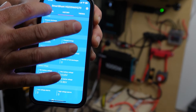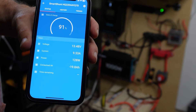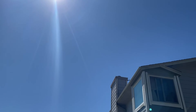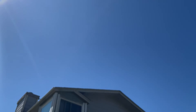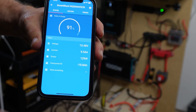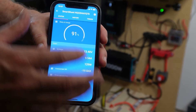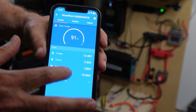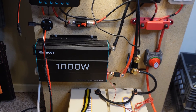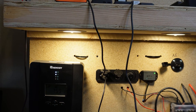In the future I'll be adding to this and seeing what I can do. Running the freezer uses about 15% and it takes about half to three-quarters of a day to refill the battery to 100%. Even on a cloudy day I should still be able to manage that. I'm going to run this for a few weeks, get some good numbers, and see what I can add. The Victron smart shunt is optional but it's really nice for getting all the information you need. Right now I'm pretty pleased with these two Power Queens.